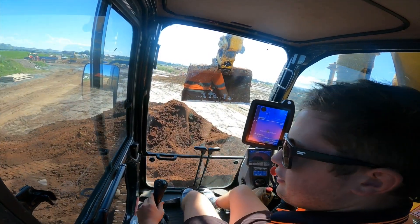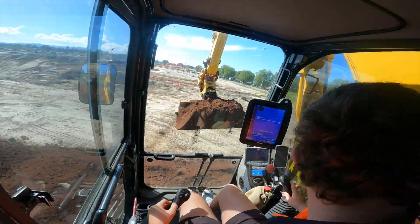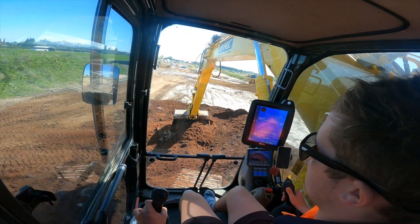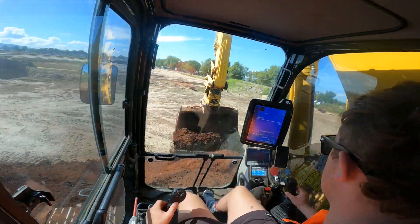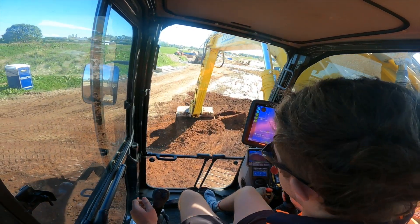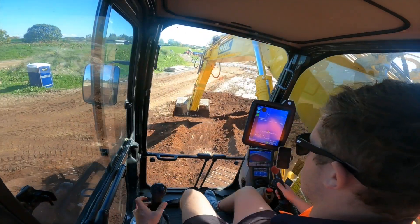The dozer's busy doing another run. I'm out of the hole so I can scoop it out — chucking the dirt up, shaking the bucket up. It's not really the best way of doing it, having trucks come in sideways and doing a bit of an ugly turnaround to my left. But it is what it is, until the pile gets a little bit longer and then we can start hitting that end. Also it's quite wet down that side so the dozer is trying to get rid of the water, and then the boys can sort of back in from where it is now. But until that, we'll just keep trucking away.